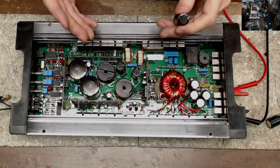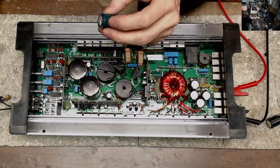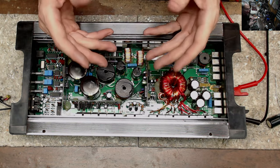I think it's a good thing to go up to a 250 volt capacitor. In my opinion, it does give a little bit more headroom when it comes to people driving the amplifiers into massive clipping or crazy low impedances that really wreak havoc on these electrolytics. Nowadays a lot of amplifiers will use film capacitors, stepping away from these electrolytic bipolar capacitors that you just can't find.